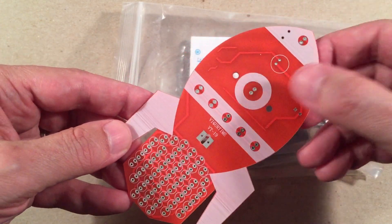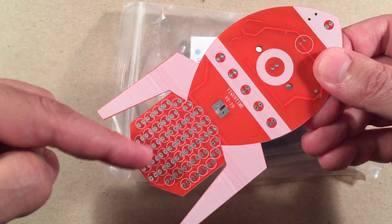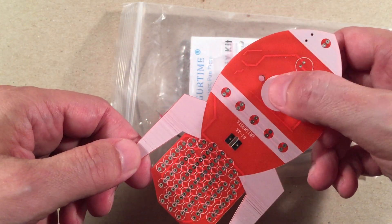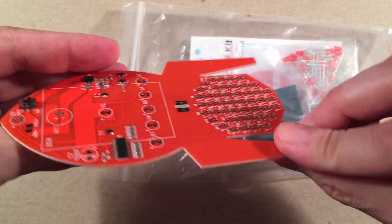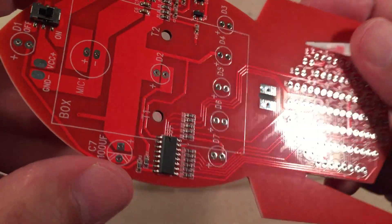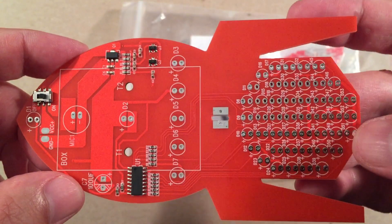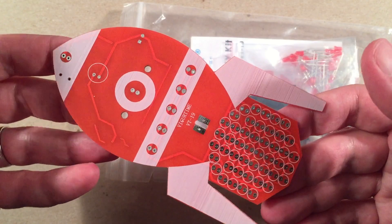It's got a microphone, and you can whistle into it to get the flames to actuate with the audio — that's pretty cool. It's going to have LEDs across here and a big LED there, just a really cool setup. A lot of soldering points, so you're going to be busy. From the factory they pre-soldered the small controller chips and resistors, so we only have to do the bigger through-hole components. Good soldering experience for $12 — totally worth it.